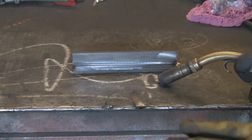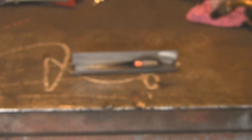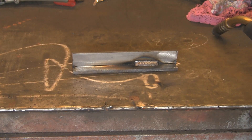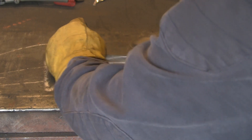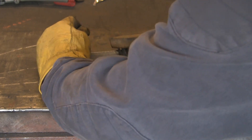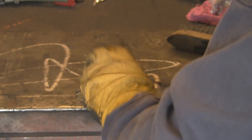I'm going to do the first one in my normal manner, just how I would normally pick up a welder and weld. I'm not going to show you the arc because continued exposure to the welding glare can damage the camera sensor. There we go — that's the first one. The welder was set up for three-mil plate from last time, and I was using it downhill, so this should be fairly okay.